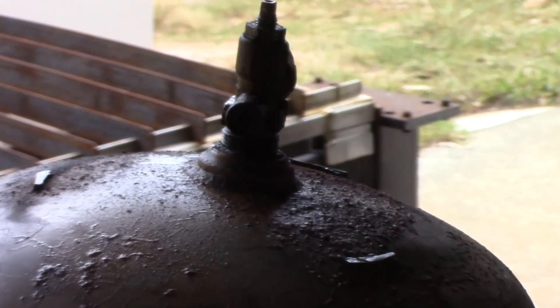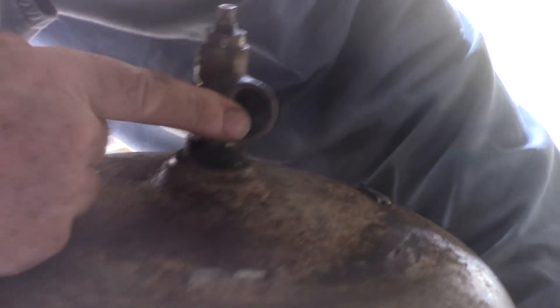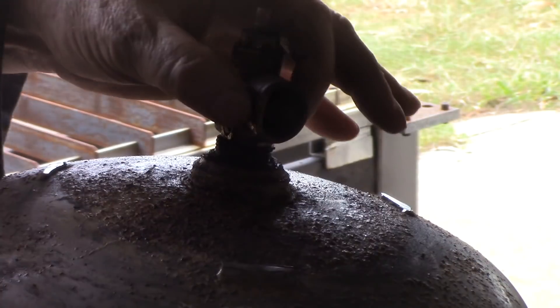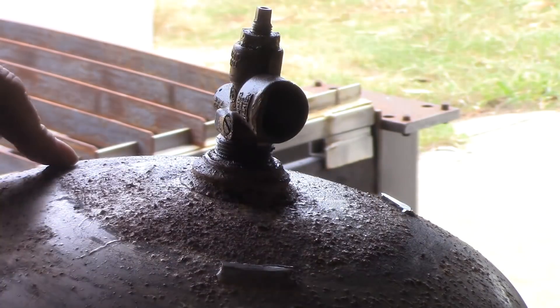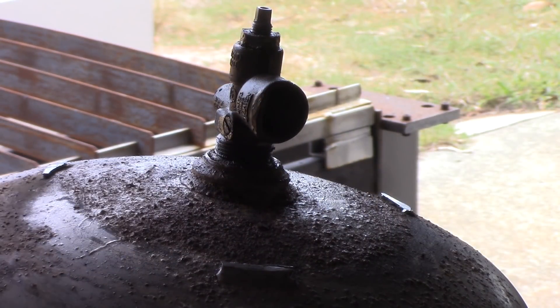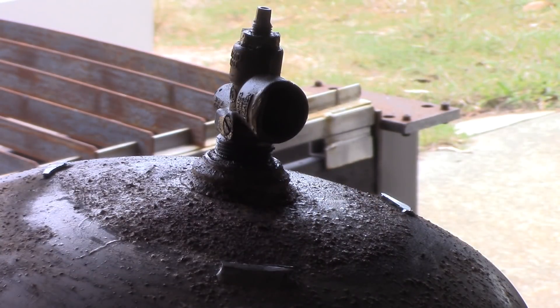As a matter of fact, I put that much pressure on the spanner that it actually bent that part of the valve in. Absolutely no way that that was going to move. So I cut the handle part off just with a cut-off wheel, so as not to put too much heat around it, because although the valve is fully open and it's been empty for a number of years, it could still have something in there that's going to go bang. So I don't want to get a flame around it just yet.